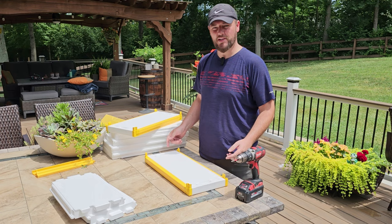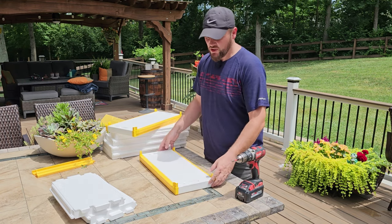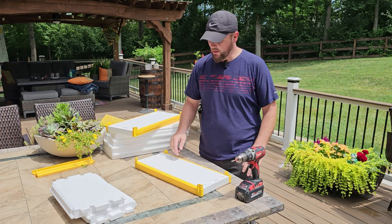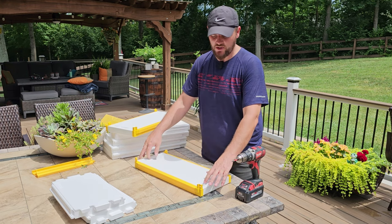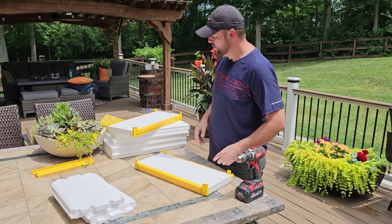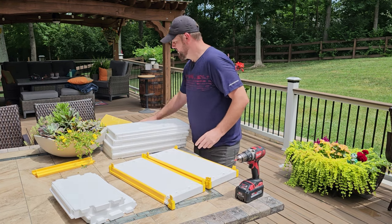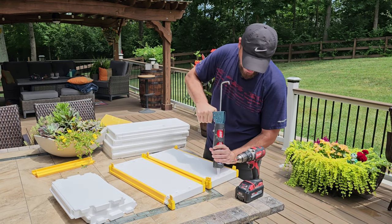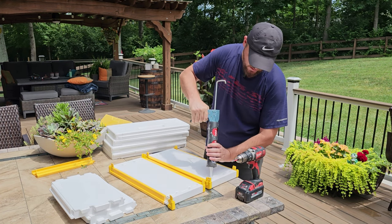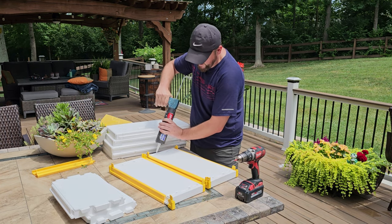So I had to go find the other piece — these are a little bit different profile than the bottom ones. Once you have this put together, which only takes a couple of minutes, you want to add some glue. I usually add glue down in these grooves here and then put the side in. I don't think you want too much glue because you are also using screws to screw these together.